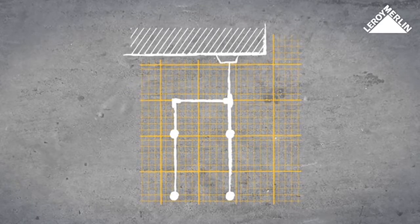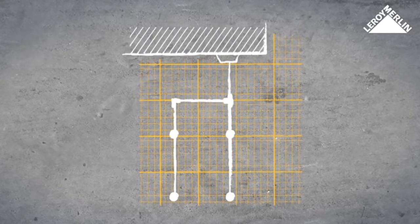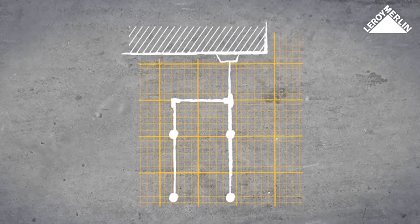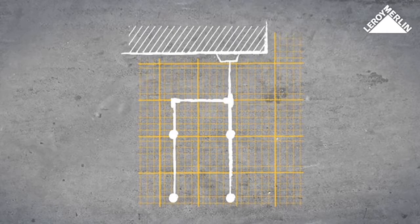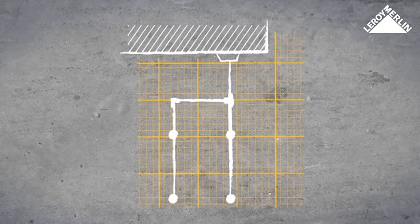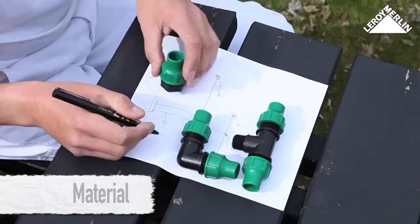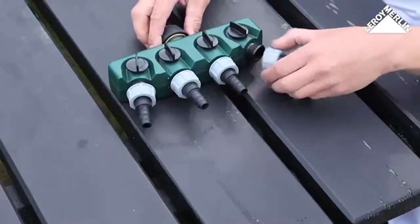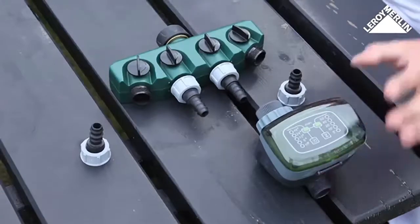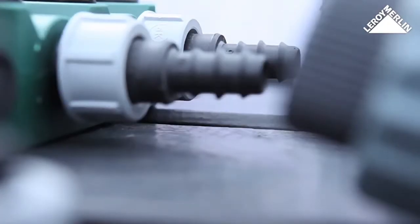This system comprises sprinklers which spray an adjustable circle of water, as well as models capable of irrigating a rectangular area of garden. A plus for the irrigation points. Mark the starting point of the irrigation circuit, usually near the garden tap. Mark the types of sprinklers required on the plan and their connectors. For the water supply, a 4-way connector will allow you to add a timer to control the sprinklers. Another for the drip-fed network, while being able to take water from the 2 remaining supplies.